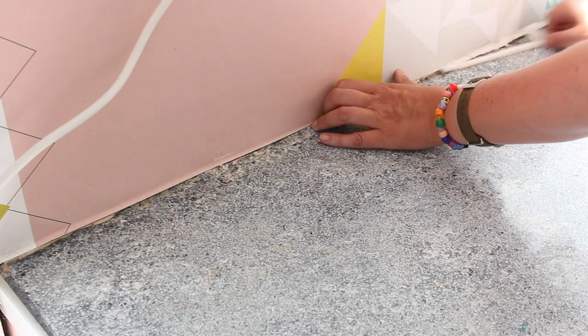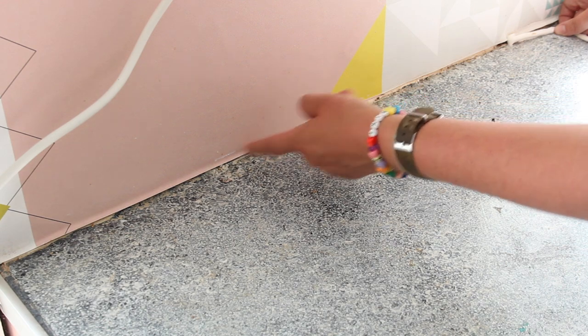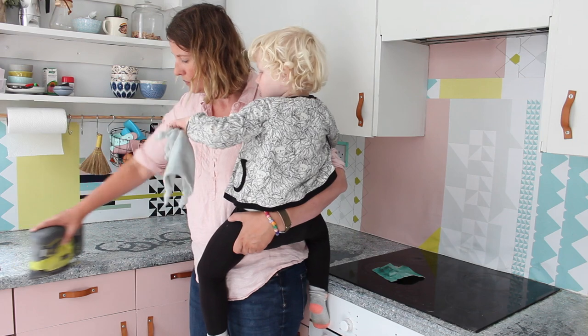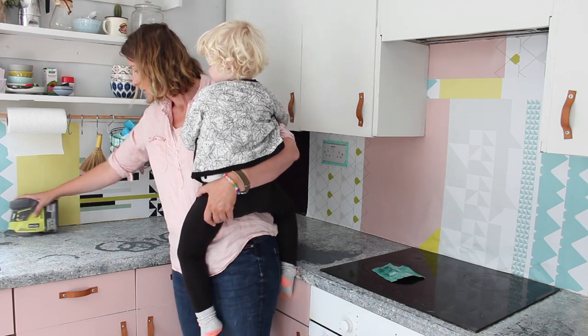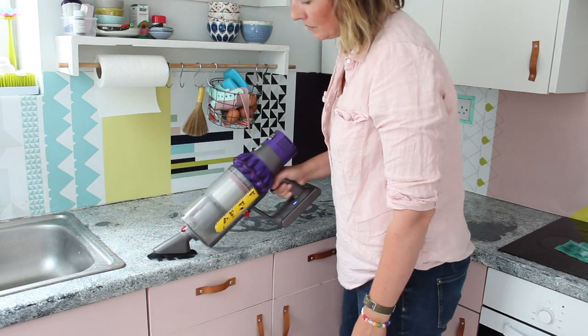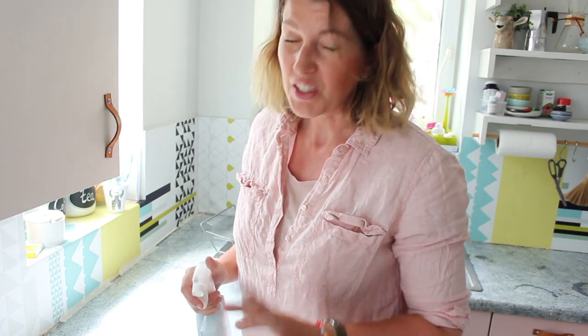The counters are all clear. What I'm going to do now is lightly sand the worktop and take away all the old sealant around the edges and around the sink. When I pulled the silicone off I also took a little bit of the wallpaper away from the wall, so I just had to re-glue that down. I took the silicone off, reattached some of the wallpaper, sanded the countertops, and now it's time for a good clean. I'm just using some white vinegar spray to make sure it's all completely grease-free. Then it's time to start painting.